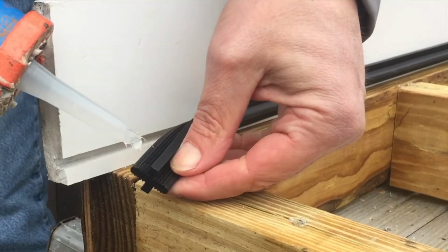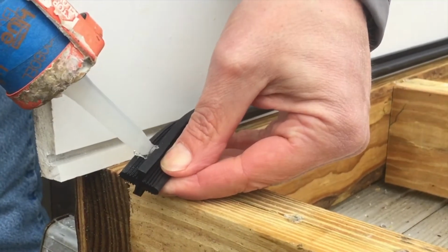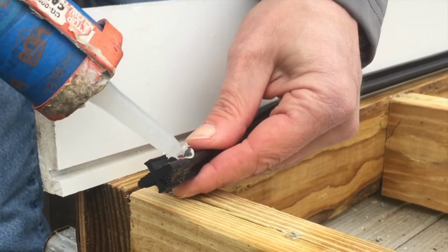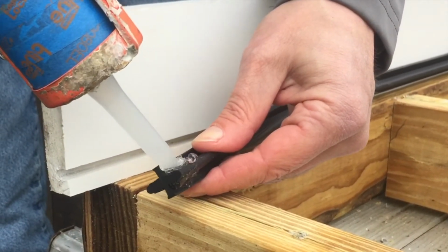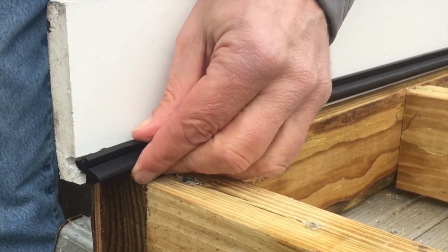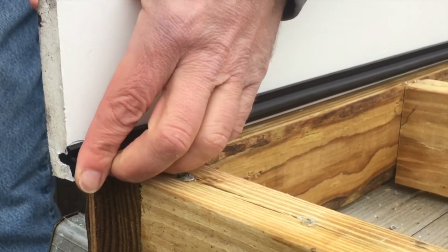Apply caulking to both ends of Coilable Dexerdry, thoroughly working it into the fins on top, bottom, and on the outer edge of the flange. Covering at least 1 inch of the flange will eliminate any runoff from infiltrating through the deck grooves on the end due to capillary action.